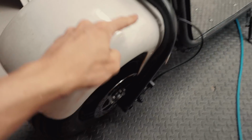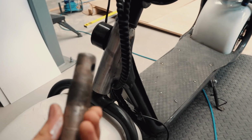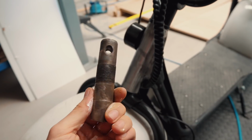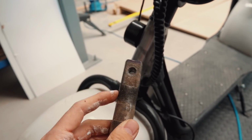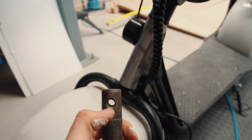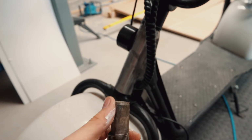That wasn't the only issue. The wheel is surrounded by this bracket here that has a shaft going through the centre of there. At the top of that shaft was this sort of mildly complex machined piece on the end. It's got an M24 thread here. It's got an M10 bolt thread there, and it's had this piece cut out.